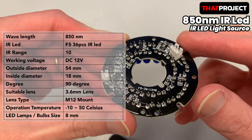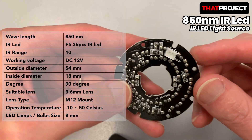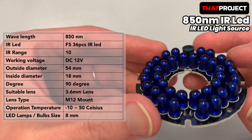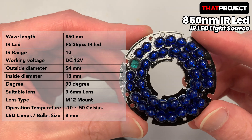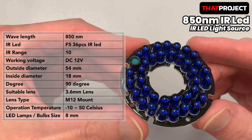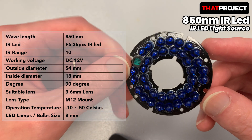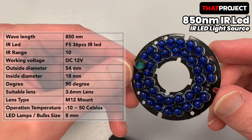The model I bought is used in general surveillance cameras. You can check the specifications for this product on the datasheet. It's a product with a wavelength of 850 nanometers. There are also many 940-nanometer products on the market, so you have to look carefully when you buy them. This product is for M12 mount. Unfortunately, there seems to be no IR light designed specifically for ESP32 cam on the market. Since the operating voltage is 12 volts, the external power is connected separately.